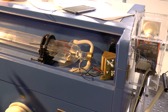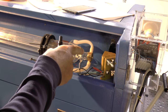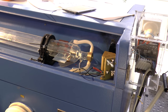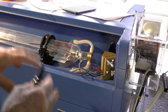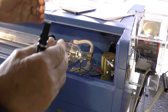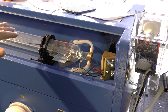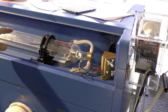This shelf life — which turns out to be the same as tube life — is all because of the way the gas is sealed in the tube. Even on a good quality tube, we've got epoxy resin around the end sealing the mirrors onto the tube, and those seals are not completely impervious. Over time you'll get leakage from the outside world into the tube itself, because the gases inside are at a partial vacuum, so external air wants to creep in and mess up the pressures and gas mix. There are two things that destroy your tube: time, and over-driving it with too much current.